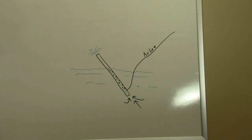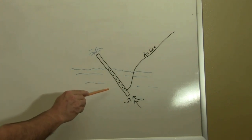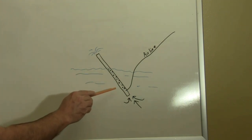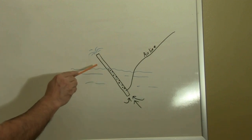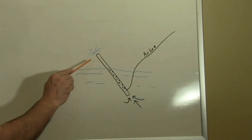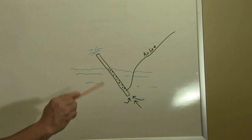Before we get started, let's see how this works. We have a piece of pipe for the vacuum's nozzle. When placed in the tank, the pipe fills up with water. By introducing air into the nozzle at the bottom, we cause the water in the pipe to raise up and spill out over the top. As the air bubbles push the water up, water and debris are sucked in from the bottom and pushed out the top of the tube.